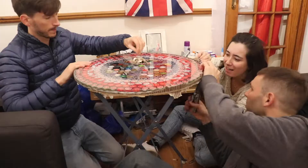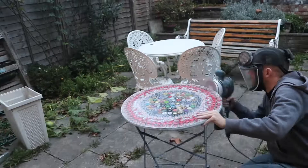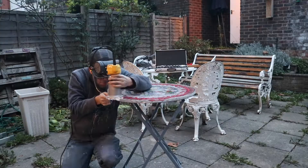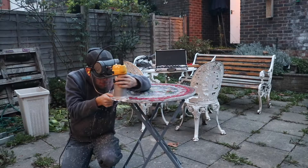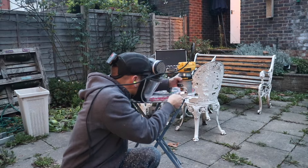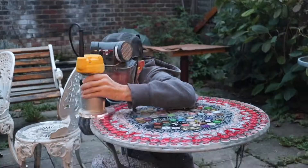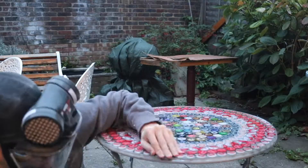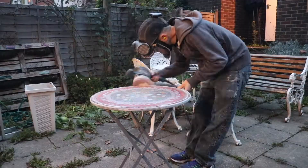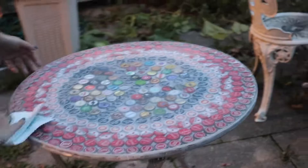That cured for a couple of days, then we had to remove all that cardboard, which was really tough, being careful not to break off any slivers. Then we sanded it around the outside and routed the nice little curve to give it that profile. On previous projects I've sanded all the way through the grits to make the table really smooth, but with this one I decided to just let it be - the top was really nice with no bubbles and completely smooth. We just kept it clean and simple, and it turned out great.